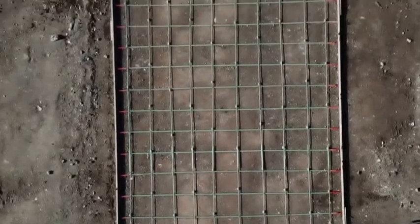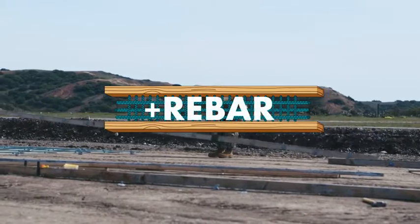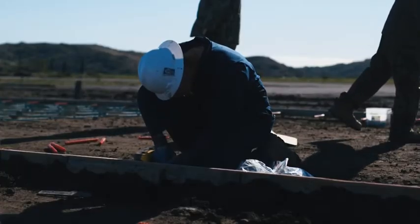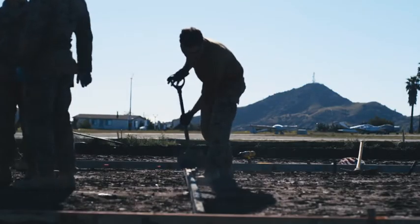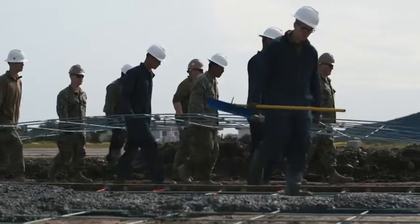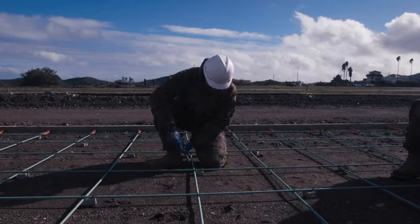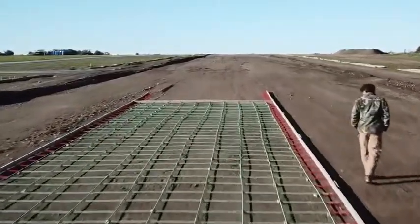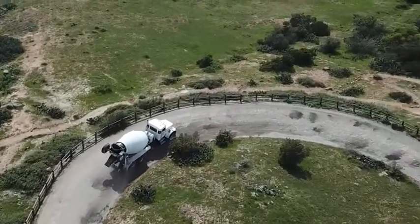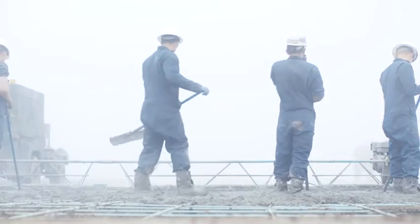The construction effort is based around wooden framing to give the actual 20-foot by 76-foot concrete pads their shape. Rebar is essentially a steel rod with ribs on it — we lay it sort of like tic-tac-toe, and when we lay concrete on top it hugs to the rebar, which improves the structural integrity. Concrete is brought up here by concrete truck; the batch plant is about an hour away, so the Marines have to work quickly to make sure the concrete is placed during its service life.